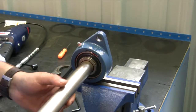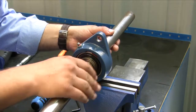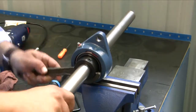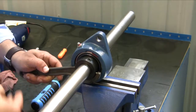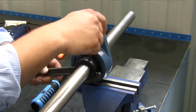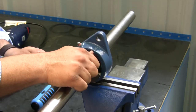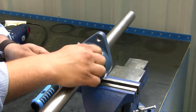Now I'm going to put the shaft through the bearing with the lock collar. After everything is lined up, put the lock collar on there and using the spanner wrench snug up the lock collar, then tighten up the allen screw until it's snug. I like to tighten it until I start seeing the allen wrench flex a little bit — that's where I stop.